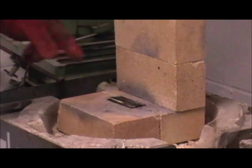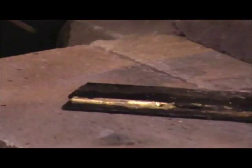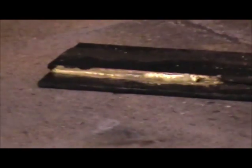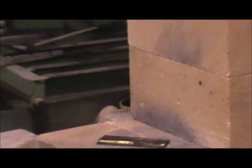Let's turn that around so you can see a little bit better. You can see here the mild steel has blackened because of the heat, but that will clean up with a little bit of wet and dry or emery paper. You can see the brass has melted and, because of the flux which causes the wetting, capillary action has drawn the brass underneath the joint and there we've got a nice strong brazed joint. So that's the process of brazing.